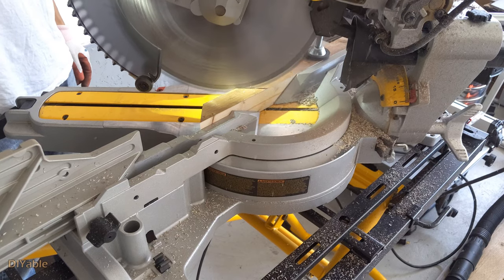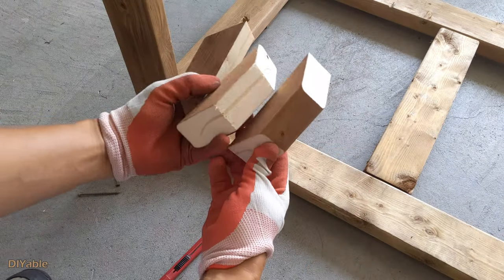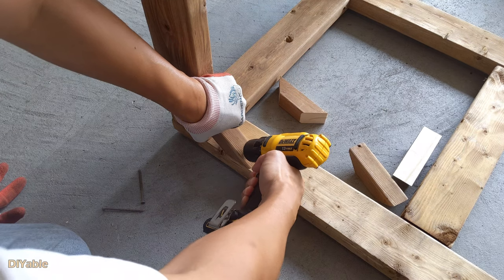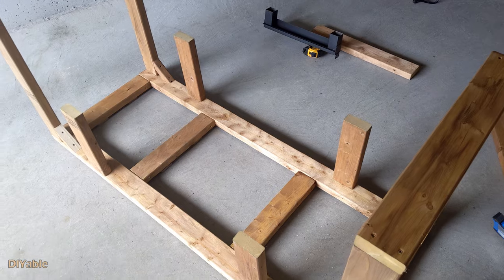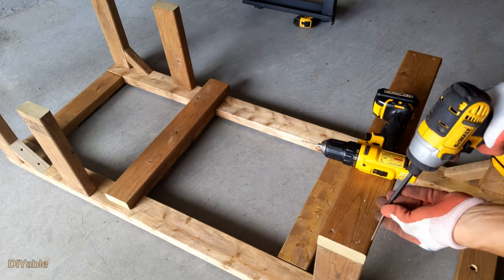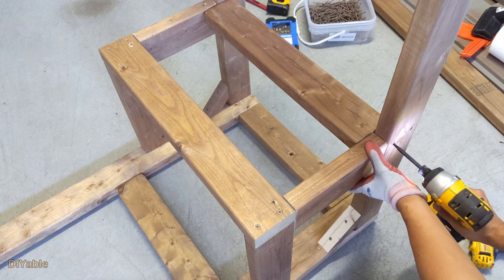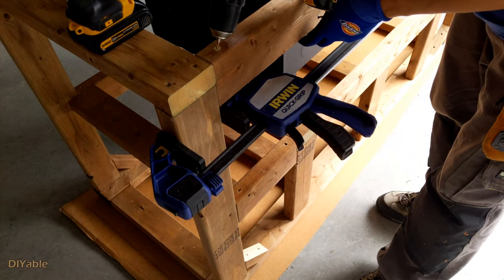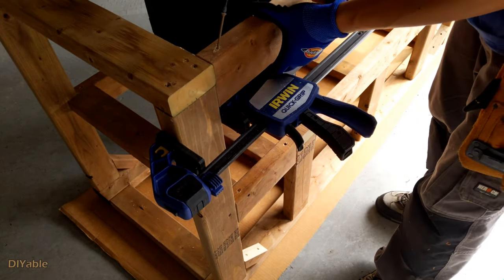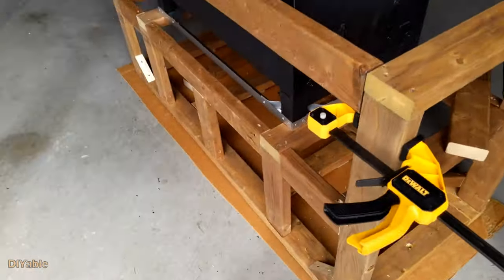It's time to go back to work on the frame. Same as the aluminum base, I am cutting some wood for the corners — that's good for reinforcement. Pre-drill it and secure it using the impact driver. I was doing the framing in the garage because I don't have to worry about the weather. Building the rest of the barbecue station is pretty straightforward. The quick grip is a very useful tool — I strongly recommend it, as you can see it helped a lot.